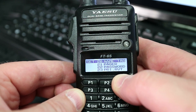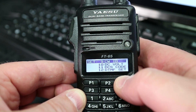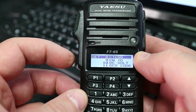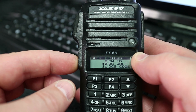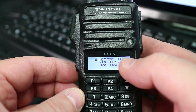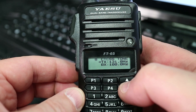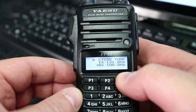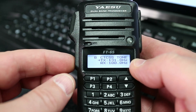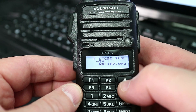You need to scroll your way through to menu number 8. Just keep scrolling through to get to menu 8 and there's CTCSS. Then press the function button once more — that will take you into the tone menu. What you need to do then is select either RX or TX. I'm going to select TX by using the function button.